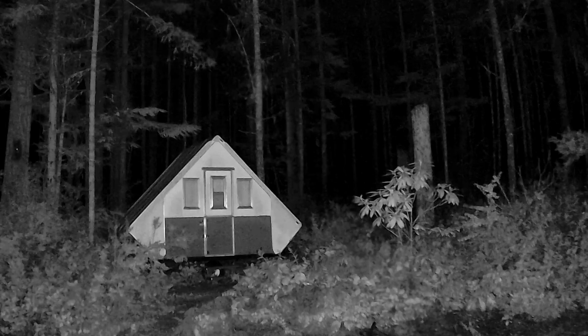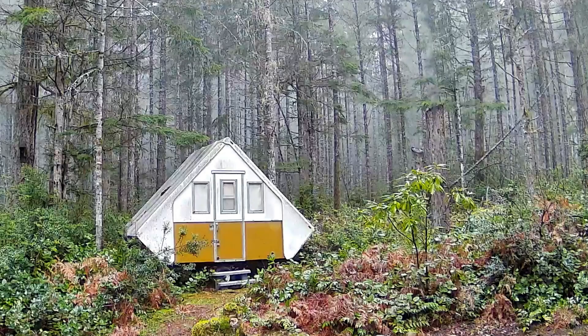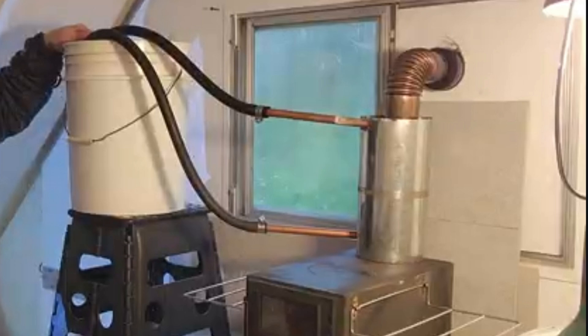I spent much of the rest of the day collecting branches and leftover firewood for a future campfire. I'm glad I got it done because, like expected, it rained all night. This is how the water heater is supposed to operate without electricity — through a natural siphon. Water enters the heating coil at the bottom; as it is superheated in the coil, the water rises, exits through the top, and returns to the bucket, creating a continuous loop until it reaches the desired temperature.